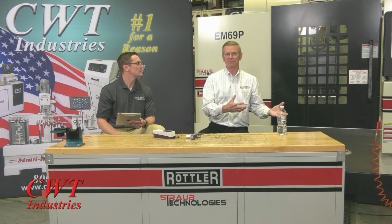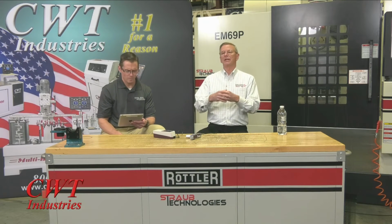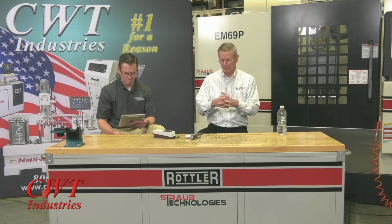That's a great question, because obviously diamond abrasives are more expensive to purchase than a standard abrasive. However, a diamond abrasive is longer lasting, and really the cost per cylinder is dramatically reduced from a standard abrasive stone.